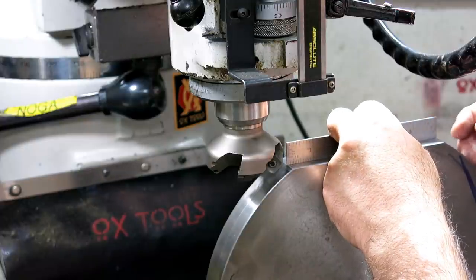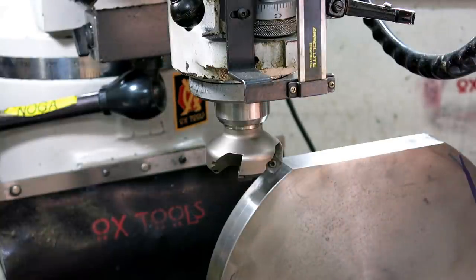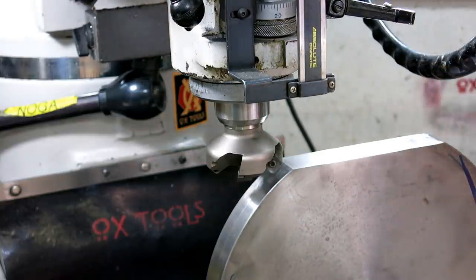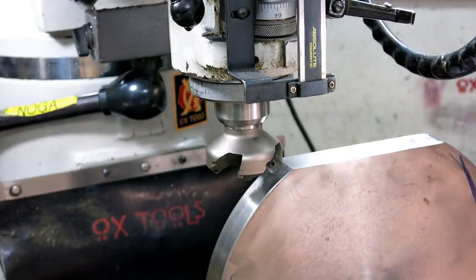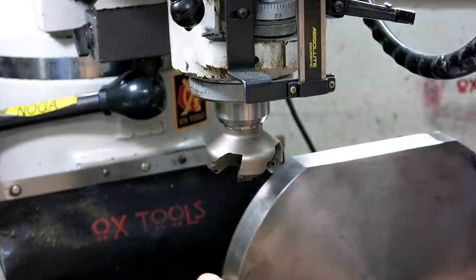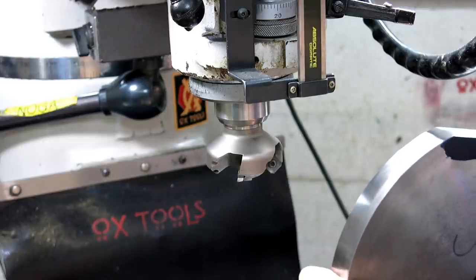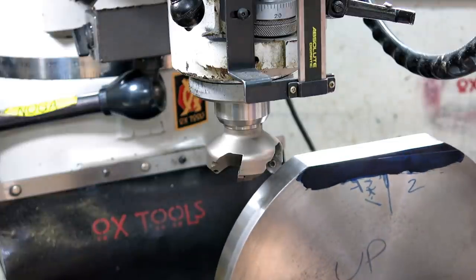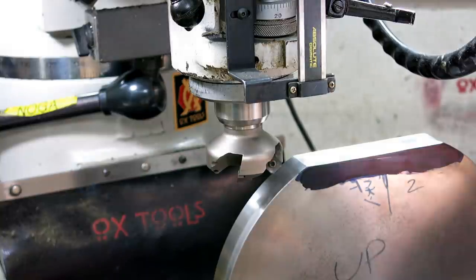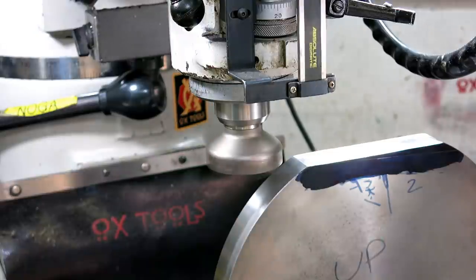It's right there at 6 inches. So, you know, I just took another 10, it was about 12 thousandths off, and I cleaned up that saw cut. So, yeah, let's flip it over again. Yep. Just heavy enough to be a pain in the neck here. Okay, make sure we're sitting down and even. Okay, and then we'll just whittle away at that until we got 6 inches.